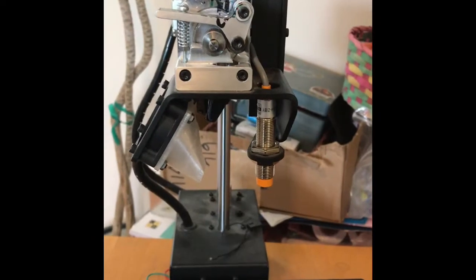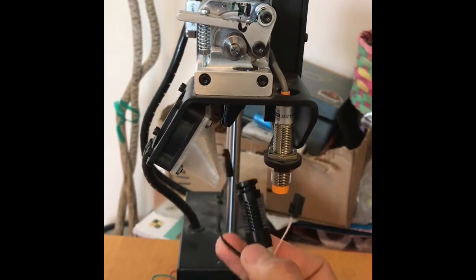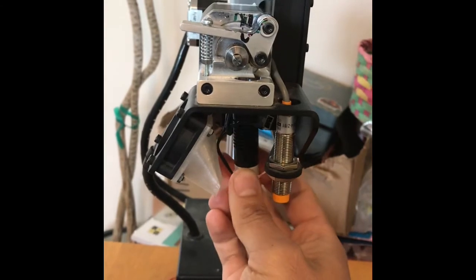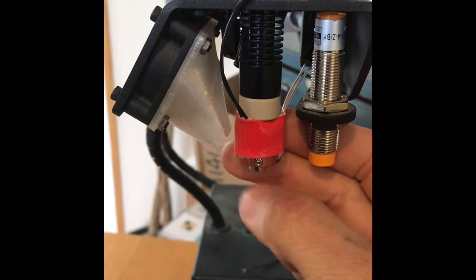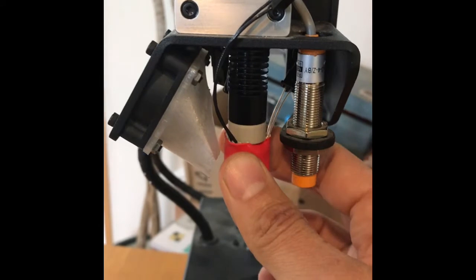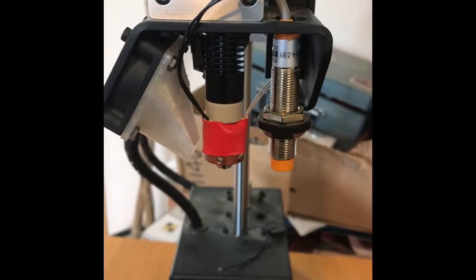Got the 3D printer here, laptop on standby. Okay, so basically, I'm gonna take the hot end and stick it in to the motor, hopper motor. It slides into this hole here. You can kind of see it sliding in. That's where the filament will drop down and melt down through here and extrude out here. Just have to tighten some nuts and hook up these two sensor wires. Then we'll be ready to test it out.